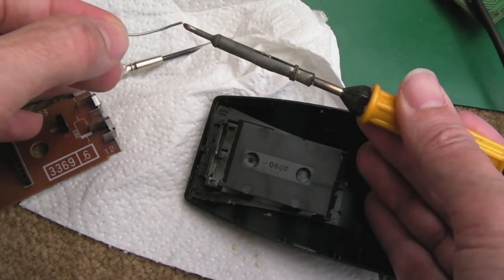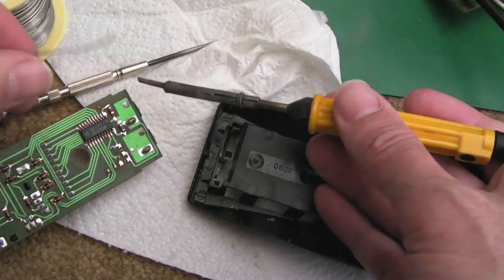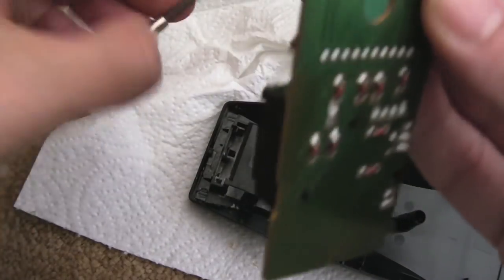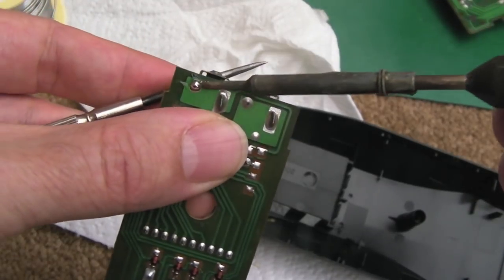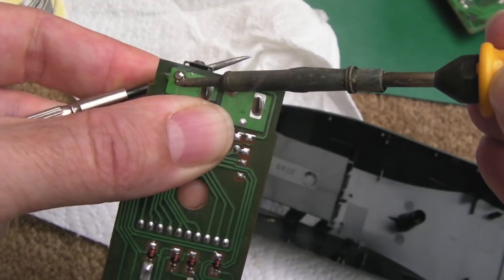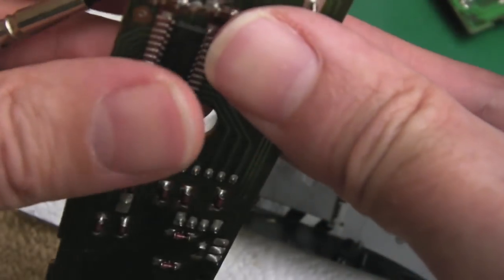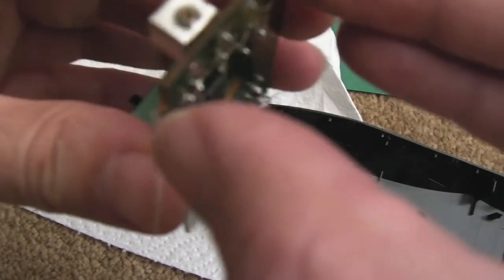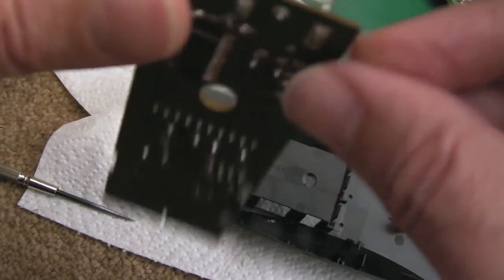So what I'll do here is just get some solder and flux onto the iron, and just get a bit of solder onto that connection there. I'm going to use something metal to hold under here to put a bit of pressure on there so that I don't burn myself, and we'll try and see if we can just push that through. Can you see that? That's a lot straighter now — just get a little bit more. That's not too bad now. It's just an imperfection from manufacture — they didn't push that all the way in, so it was raised up. It still is just a little bit raised on that side, but I could heat that further.